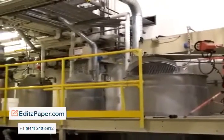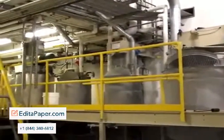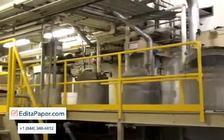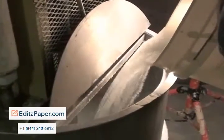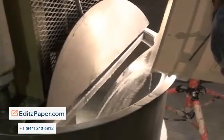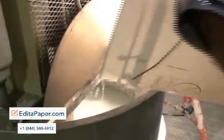First, Ultrox is used to complete the coater system boilouts. In this example, two different makedown systems require cleaning. The first system had been used to premix a number of pigments. Ultrox L was added to the tank along with a small amount of caustic. The caustic is used to activate the oxidizing component.